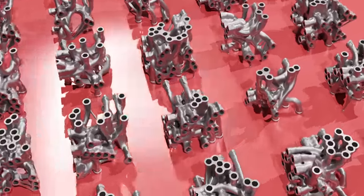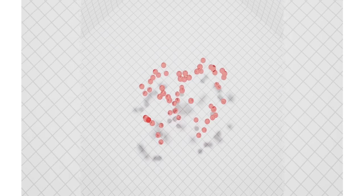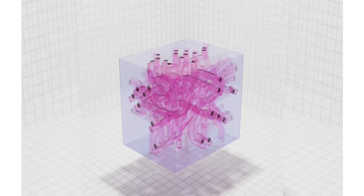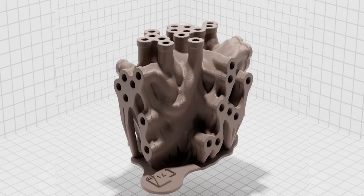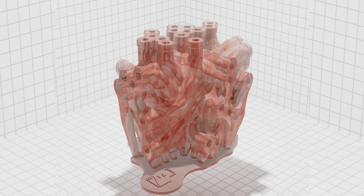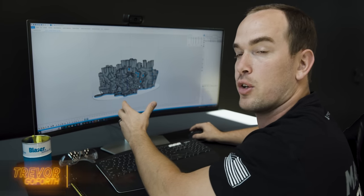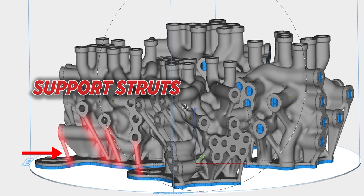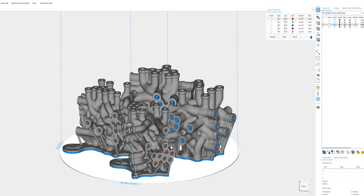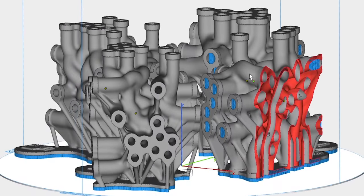Here are the hydraulic manifolds. They were designed using an algorithmic engineering approach by a company called Leap 71. You can tell the algorithm things like your wall thickness, minimum overhanging angle, port size, and all the other parameters you need for your manifold design. When you run the algorithm it reroutes all of your ports so they don't collide and so they have the appropriate wall thickness. It also creates support struts, allowing you to design any port out in space. In a sectional view you can see that it would be very difficult — or even impossible — to remove support structures from inside these manifolds.